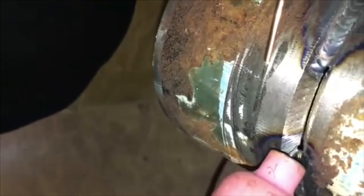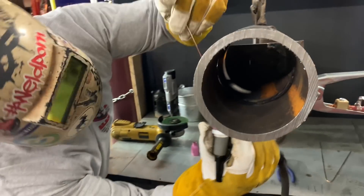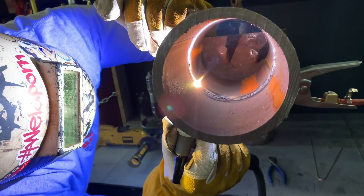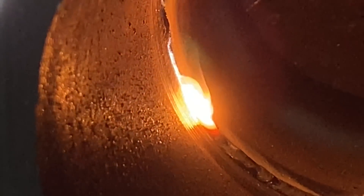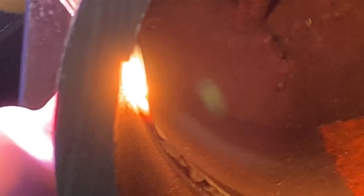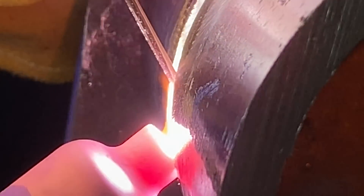I don't know if y'all can hear all the fireworks popping off behind me, but it is New Year's Eve, ladies and gentlemen. Here it is again without an arc — start coming up this side a little bit further. You can actually see the bead really well in there, and you can see there's no wire on the inside of the pipe. I'm face feeding it all the way. You have to have your amps up, and you have to concentrate that arc when you do add the wire. But you can push it through all day long.